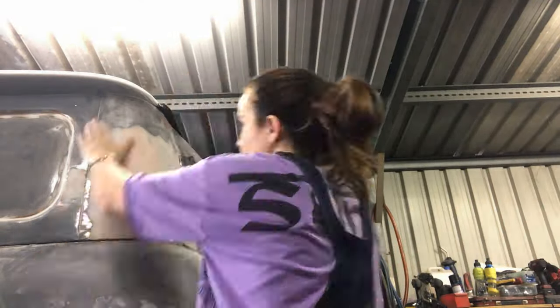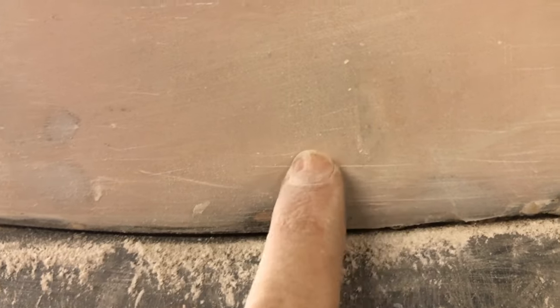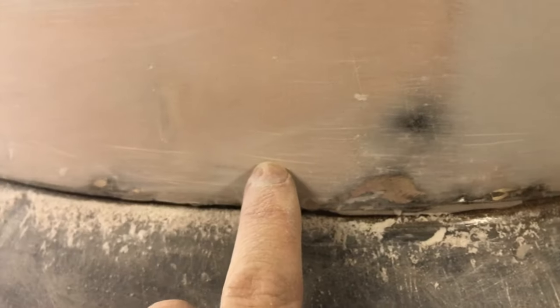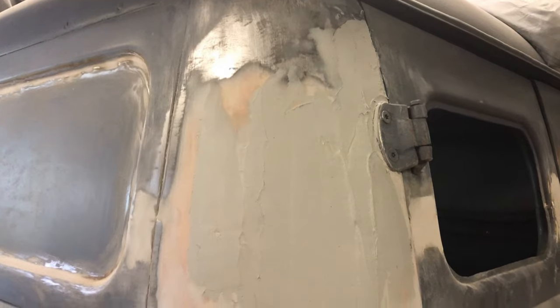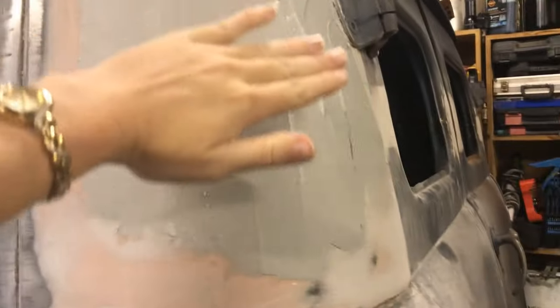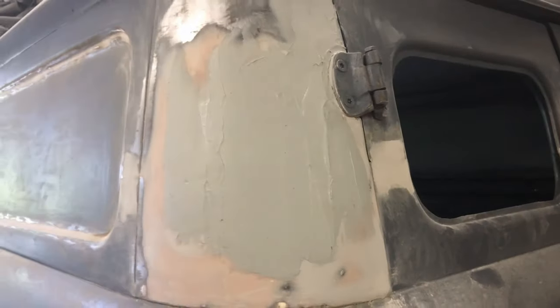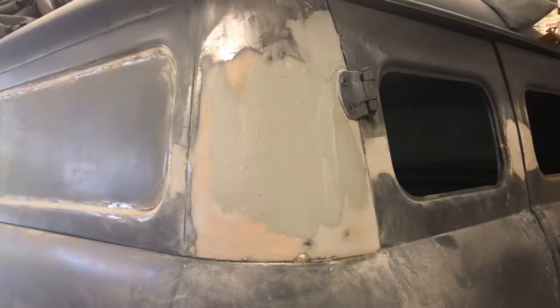It's feeling pretty smooth. There are a couple of spots, like these little bits here, that need to come out because you'll see them through the paint. I've just given it another pass over because after all that sanding there's a little bit of a low spot just here, and because it's a curved surface you would have seen it — so here we go again.